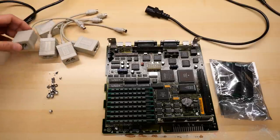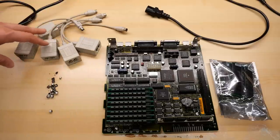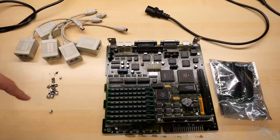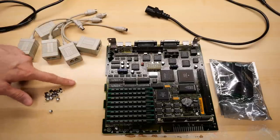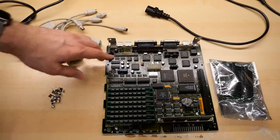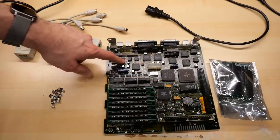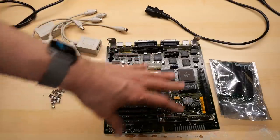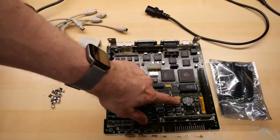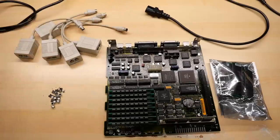These AppleTalk adapters all work as well — I did a quick test with these off-camera. If you want to see more about how AppleTalk works, check out my video on that subject — I'll put a link in the description. These are the bad parts I took off this board, just these bad old electrolytics. In case anyone's wondering, there are ten 47 microfarad caps on here and one single 1 microfarad 50-volt cap. I happen to have those in stock from other recappings I did, so it was pretty easy. And of course, a CR2032 battery and battery holder. This motherboard is looking awesome.